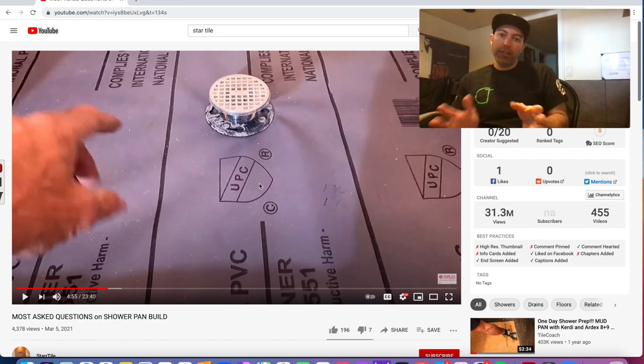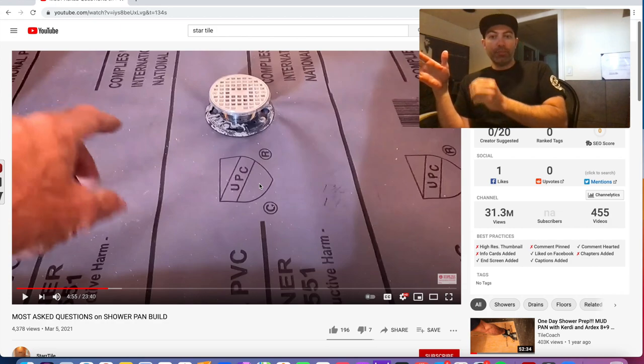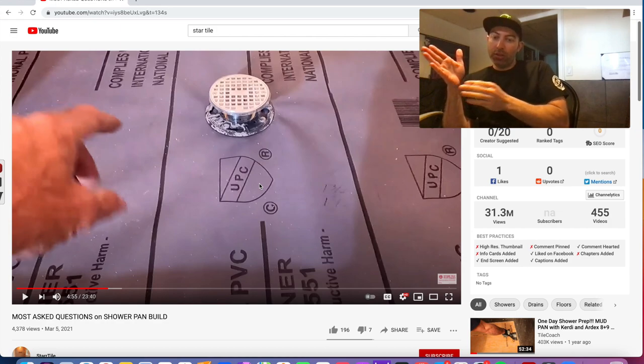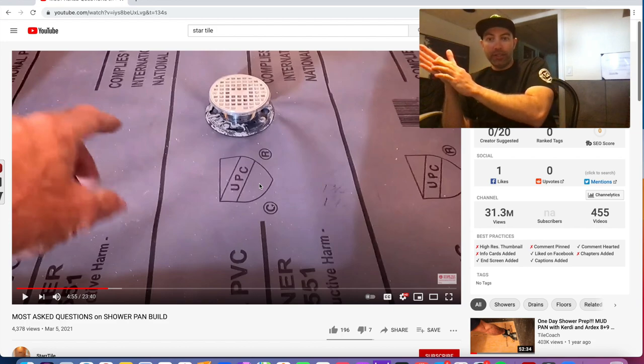The best way to get the pitch per foot is, let's say you've got an inch at the drain and it's 2 feet from the wall, okay? So you need 1/4 inch per foot, so you're going to need a 1/2 inch higher at the wall than at the drain. So how much do you need at the wall? Let's say the drain is an inch off the floor. And over here, we're 2 feet away, 1/4 inch per foot. So you've got 1/4 and 1/4, that's 1/2 inch. You need 1.5 inches at the wall.